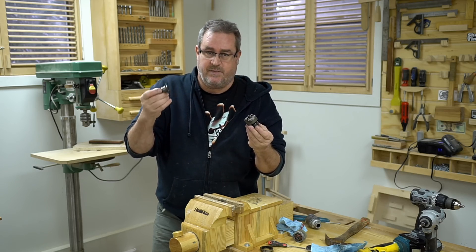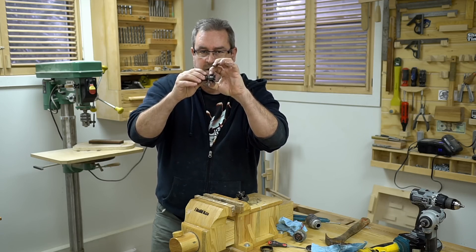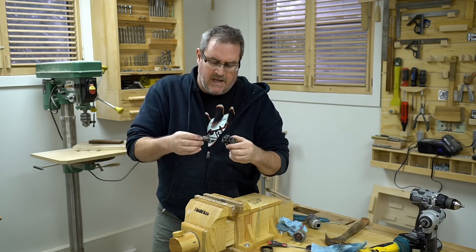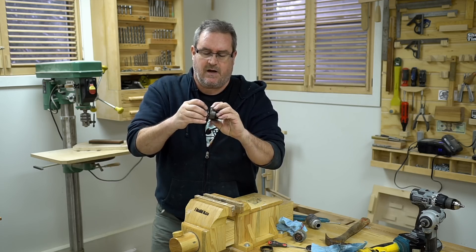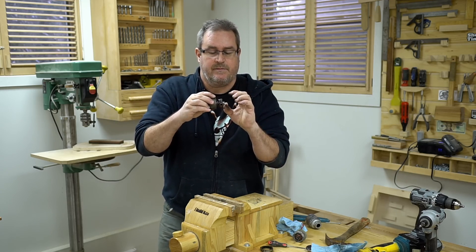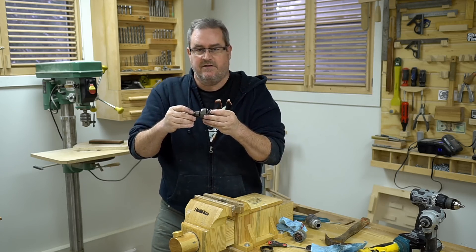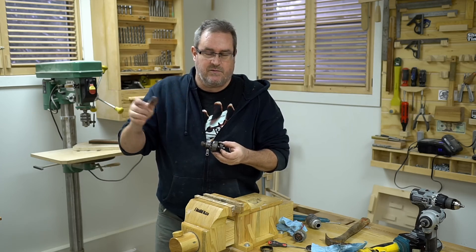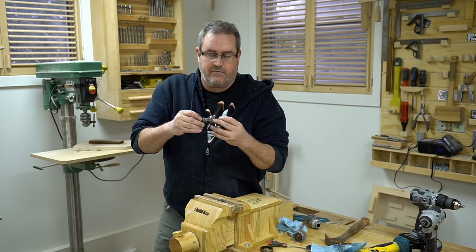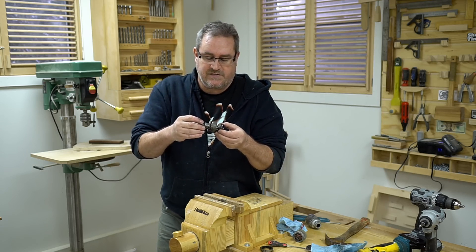The parts that wear out: the big one I found is the bearing on the front — they always loosen up from the steady striking action. The other parts that wear out are the striking surfaces. Over time the spring will loosen up, though it's very rare for it to break. I don't know why mine broke that time — might have been a problem with that individual spring. Those things happen randomly and you really can't account for it. We've had like 20 impact drivers and that was the only one where the spring actually broke.